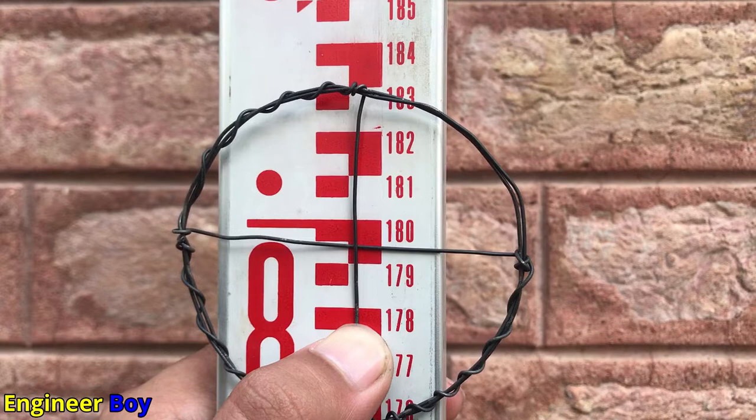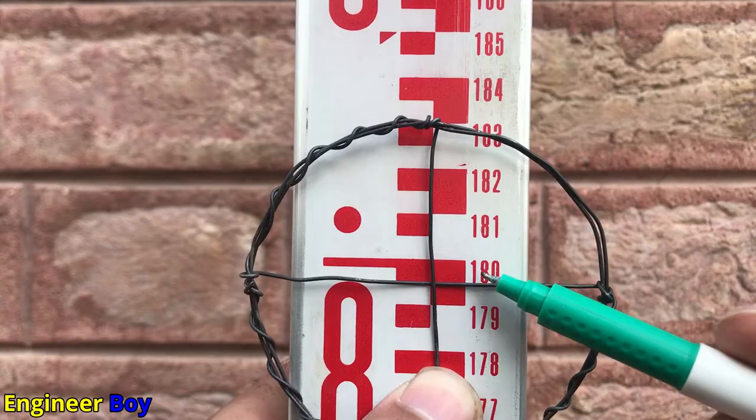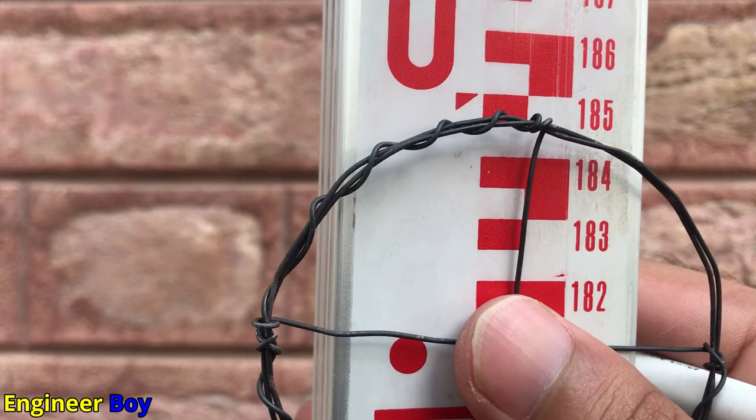Let's try another point. As you can see, we are just above 179 and below 180 centimeters, so 1.79 is completed. Now we count the millimeters: from 179 to 180 those are 10 mm, and the crosshair is right at the midpoint, so we take 5 mm. The reading is 1.795 meters.